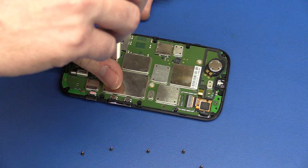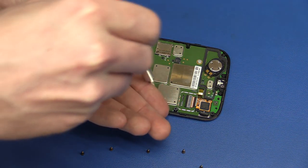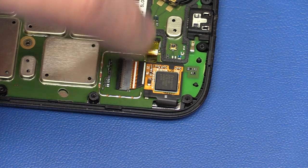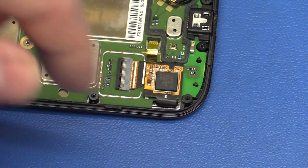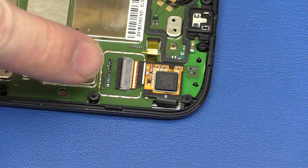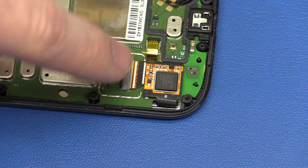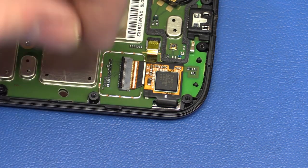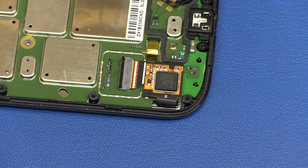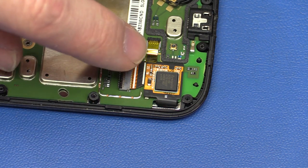And to take the board out, we'll need to undo these screws as well. And these connectors for the LCD and touchscreen, I believe it is, we need to unplug those also. And they are also a little different from time to time, these connectors. These have two hinges here, so you can flip this whole part like that, and now you can pull the cable out this way. Some of them you have to pull, like they slide into the connector instead. That's a little different, but you can see it if you look closely. You can see the hinges if it is this type.